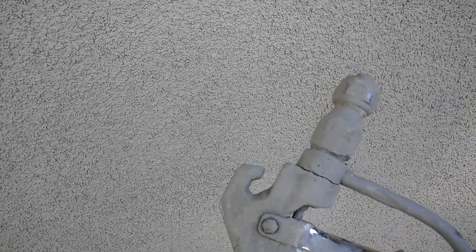The other thing is, do not use a spray pole unless you have to, because when you use a spray pole, you get 50% more overspray than you do with a handgun. A professional who's been doing this for years knows this, if he's ever learned anything in his life. But some guys just haven't. They've been doing this for years and they never learn. So let me show you guys the technique in the spray.